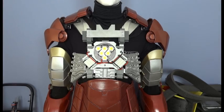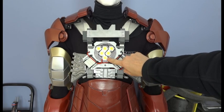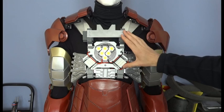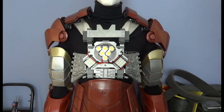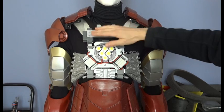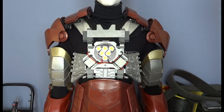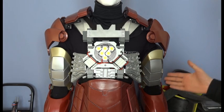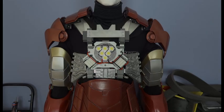The unibeam of the suit is something that I made some time ago. It consists of six 10-watt LEDs. There's a two-part series already on this, and it's fitted onto a 3D printed and aluminium strip chassis. All of this is basically the mechanics that hold the whole strapping system together. We need to fit the batteries, the transmitter electronics for the helmet, and the control electronics for the unibeam into the suit somewhere and wire those in so they can be activated whilst it's being worn.